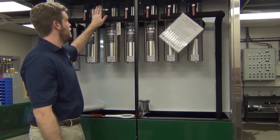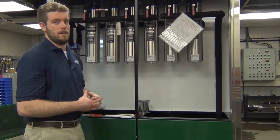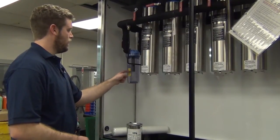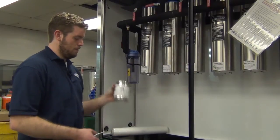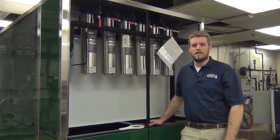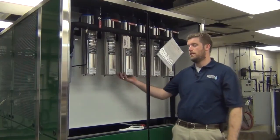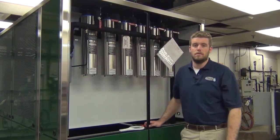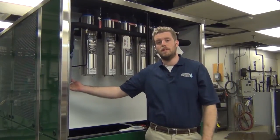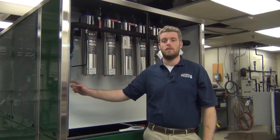Every filter housing has a ball valve on the inlet and outlet side for isolation and maintenance. Along with installing the filter and purifier elements, you're going to want to fill the phosphate feeder up to the fill line with glassy phosphate from your consumables kit. Some scheduled maintenance to keep in mind: we recommend changing filter cartridge and purifier cartridge elements every four months or as needed. For the phosphate, it depends on water usage — keep an eye on it and make sure it isn't completely depleted. You may need to refill it to the fill line every four to six months.